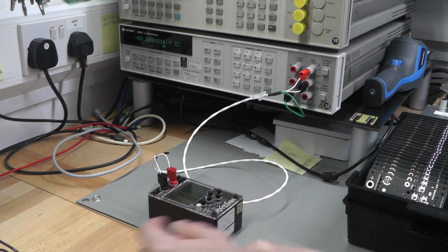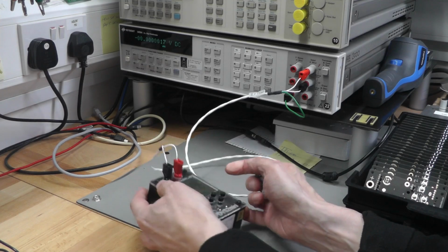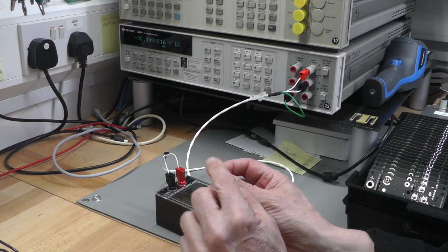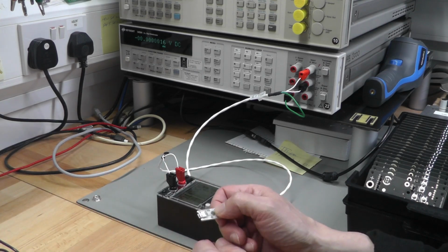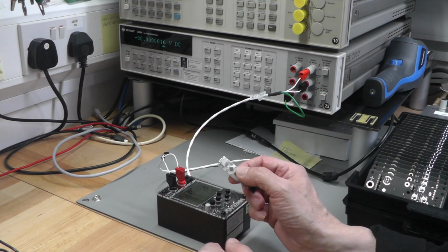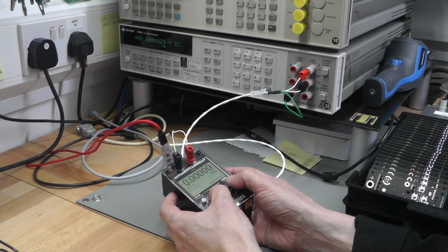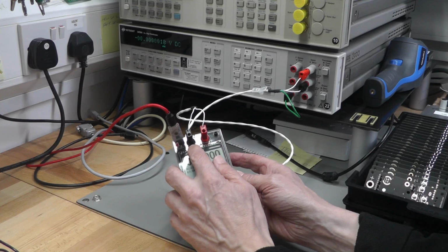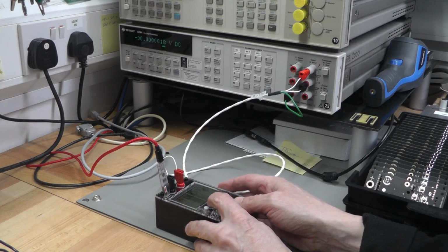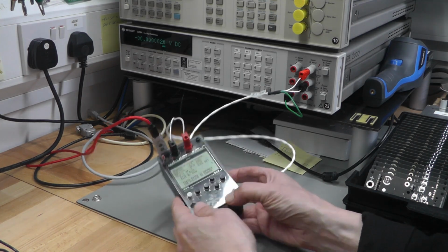So how do I do that? Well, there's actually a serial header on the front of the PDVS2 Mini there, and I make use of these adapters here to connect that via USB to my Windows 10 PC, and that connects up this entire control loop. So I'll do that now. With it connected, the next thing I do is enable the serial comms, and you can see that the LED's flashing there. That's every packet going out. And the next thing is just put the PDVS2 Mini in calibration mode and just leave it sitting like that.